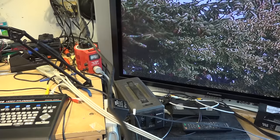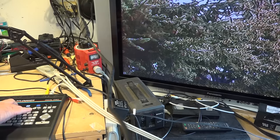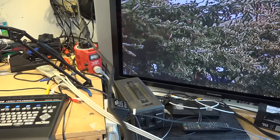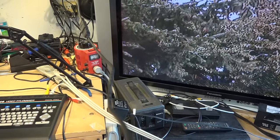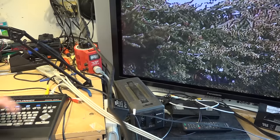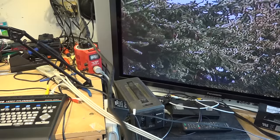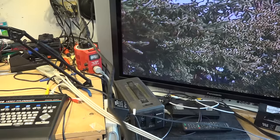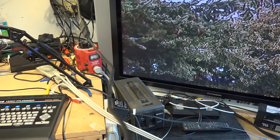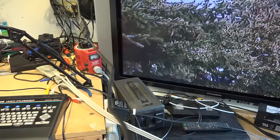title makers. And the TM2000 was exactly the same as far as the way it operated as the Videonics title maker. No different, other than the fact that the TM2000, I think it maybe had a few more fonts, but it had the monitor and the preview out. Whereas this one, basically, the preview out on the TM2000 would operate the same as this. So if you were only running a single monitor setup, you could just use the preview out instead of using the main video out, and it would give you your overlay so that you could set your graphics up. So you could use the TM2000 exactly the same way as this. It just had an isolated output so that you could preview your graphics while not affecting your line out video, if you can follow me there.